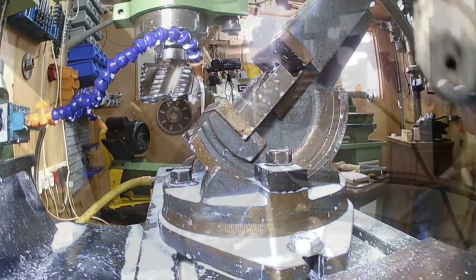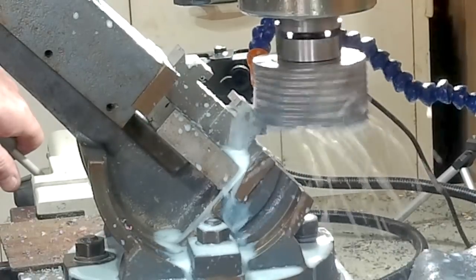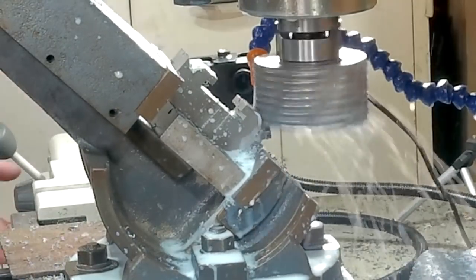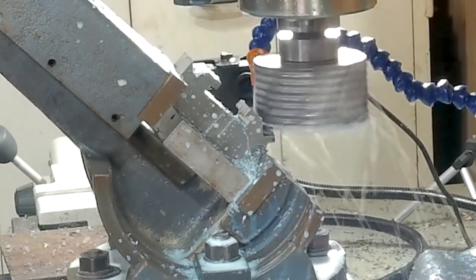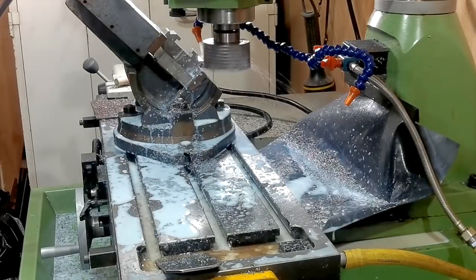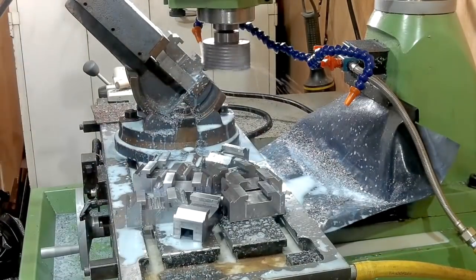When the first side is finished I remove the blank, move the cutter back to its starting position, replace the blank rotating the vise 180 degrees round, clamp it and then machine that groove. Now this is done I am able to slide the blank over the quick change tool post and check it for fit. I did this with all 12 pieces and they had a reasonable fit — in fact certainly better than the two tool holders I already have, but these are by no means finished.